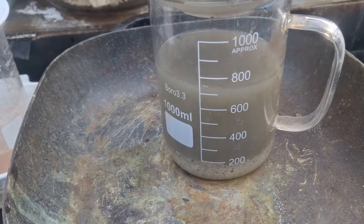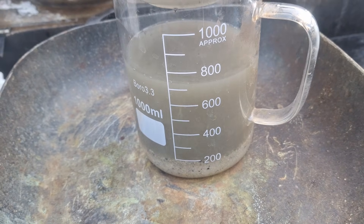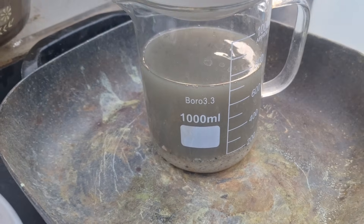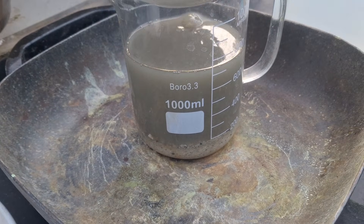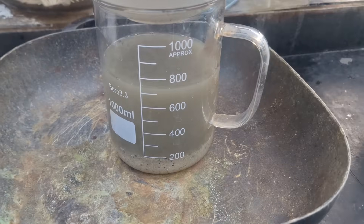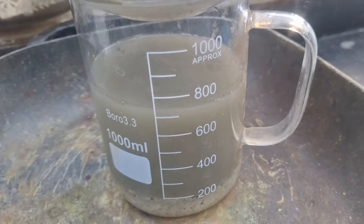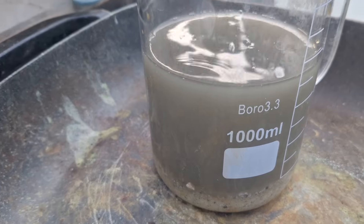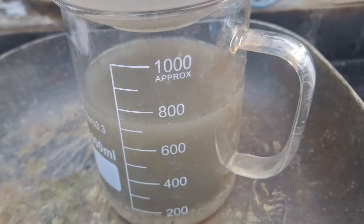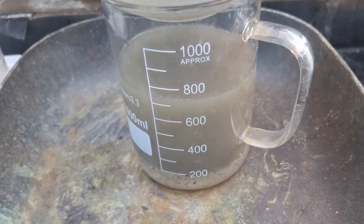It's been roughly three hours running. pH is still about 11 — that's good. I gave it a heavy stir, got it all mixed up. It looked almost that cloudy before I started stirring, then settled out really fast, but there's a bit more material suspended in solution now. We're stripping those sulfides down.